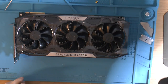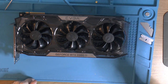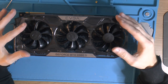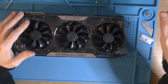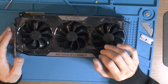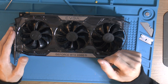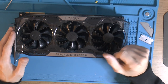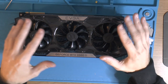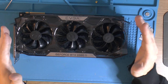The thing with temperatures and equipment is that nothing is calibrated. I haven't had any calibration done, so I don't know if my infrared is correct, or how this Atten compares to every other Atten station out there. And obviously people have different hot air stations with different power levels. Mine is 1000 watts, that's the maximum it can give. So when it comes to temperature, it depends on the equipment, how it's calibrated obviously, and how you work with it.